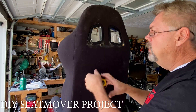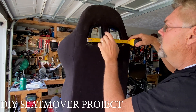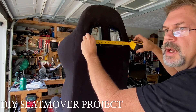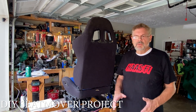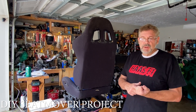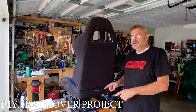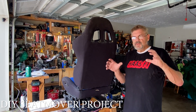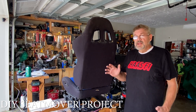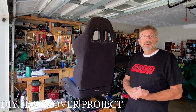On the other rig I made a full frame, but on this one I'm just going to attach to the top section and use it as the lever. We need a piece of metal about 10 to 10.5 inches long — that's where we'll attach the two tie rod ends up top. And real quick — if you're thinking this is so much work, we've paid nothing for it so far, maybe 100 bucks. You guys put more into your steering wheels and pedals than this whole thing. My philosophy is you should put at least as much money into your motion platform as your controls, because you want it to be cool and reliable.